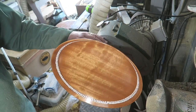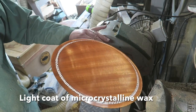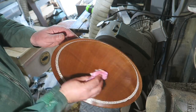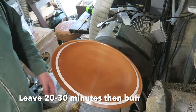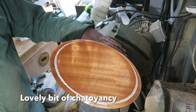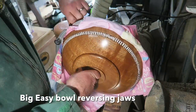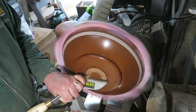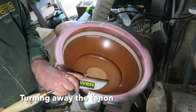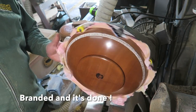Two coats of sanding sealer and more Yorkshire Grit. And there it is. Just put a light coat of microcrystalline wax on it to finish it — this is the Renaissance brand, but there are quite a few around. Leave that for 20 to 30 minutes and then buff it off. Lovely bit of chatoyancy there. Bowl reversing jaws — I think that's on the easy chuck because they're the biggest set of jaws I've got. I'm just turning away that tenon using a bowl gouge, bit of sanding, bit of branding, and we're done.